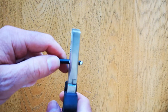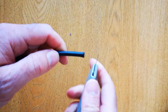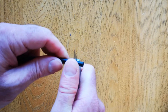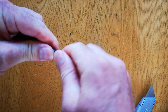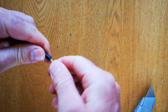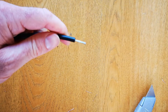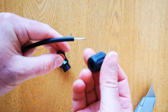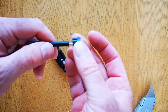Now I'll show you how to do a negative end. Cut your cable where it needs to be with a pair of pliers. Use a Stanley knife or a cable stripper to strip 10mm off the end. Twist the insulation off and then twist the bare cable to stop it fraying. Take the cable restraint and the nut off the MC4 connector and thread them onto the wire.